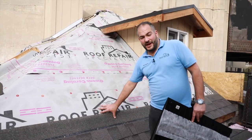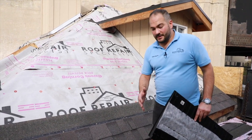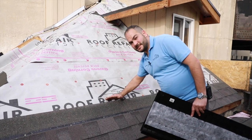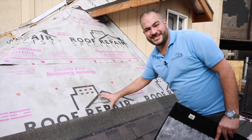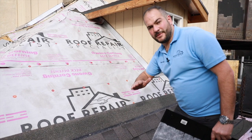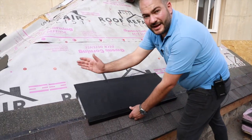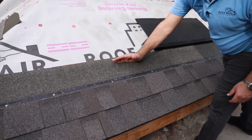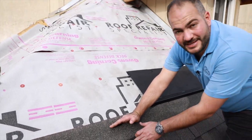We've located where our attic starts. You'll need to do the same thing on your roof, which is a little complicated. Essentially, first you want to find out where your attic insulation stops — that way you know where to start venting from. You want to vent as low as possible in your attic, but past the point of your insulation to make sure you have proper airflow. When you install this, it's going to be five to six inches above that line. We've measured and determined that our attic starts right around here, so we're ready to start this inflow vent.